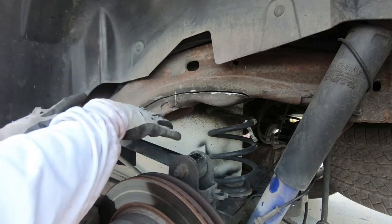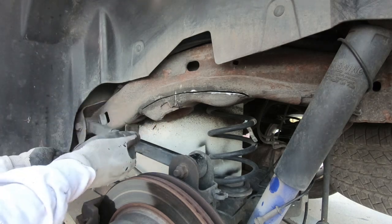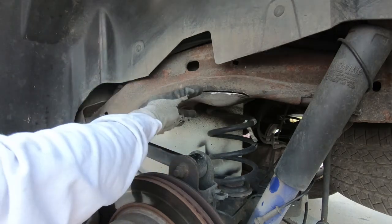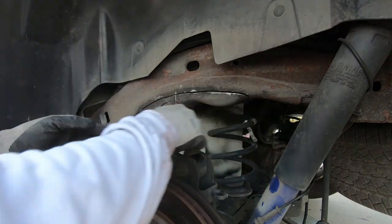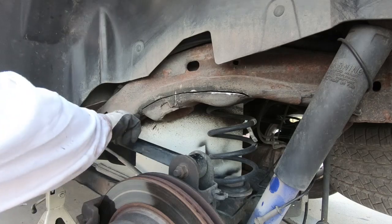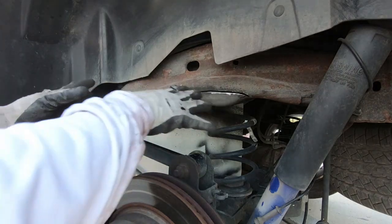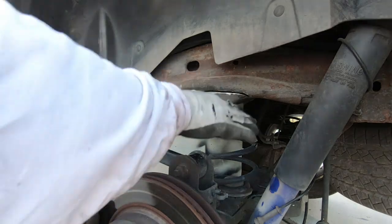And if I get too close, we'll go into this and not the tank, because the tank is plastic. So I just wedge that up in there. But other than that, I've done the exact same thing. So I've cut my relief cut. I've got it cut down the side here and a majority of the side here. Now that I've got the metal in, I'm gonna go ahead and cut the rest of the way. But then it's just like the other side. So I'm gonna go ahead, bend it down, trim the back edge off.